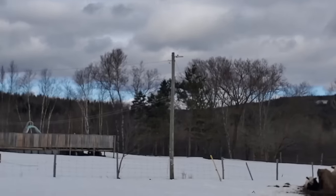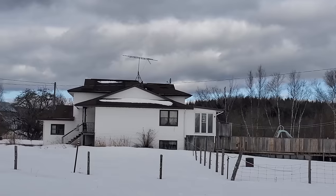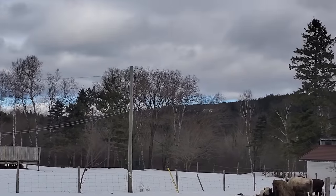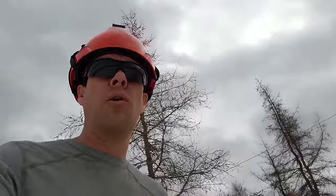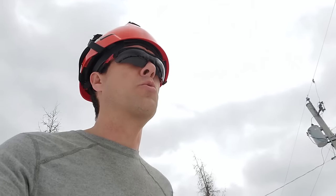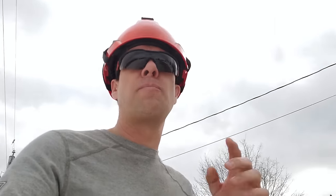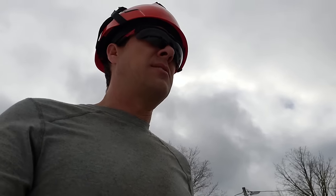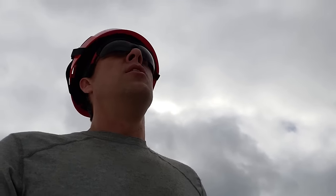I'm going to be climbing up there. Where they want to get rid of that light permanently, we're going to drop that wire. There's quite a bit of tension on it even though it's only probably number four duplex. The last thing we want is to be on top of that pole, cut that wire, and let it fly - there's a real hazard of the pole snapping with a quick release of load. We could bring up come-alongs and grab some tension, release it, use a hand line, and lower it down slowly. That's an option, but it's a lot more gear to lug through the snow.